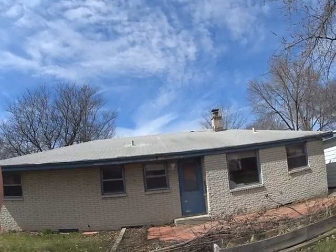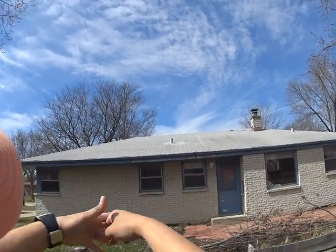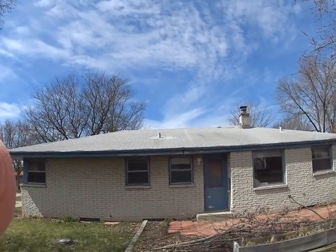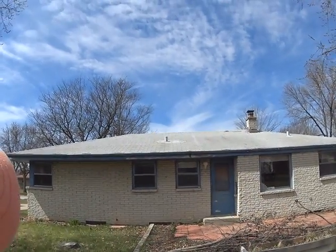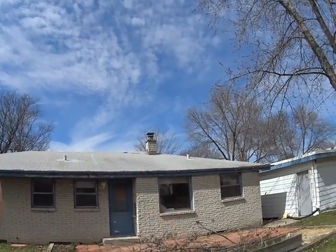Water gets in and just soaks up in the area, and then you possibly have bad sheeting, bad drywall underneath, or it goes right down to the basement because it seeps down and follows that 2x4 all the way down and damages all the wood, the framework. A lot of bowing here.